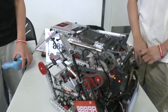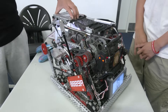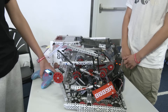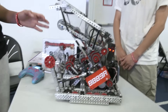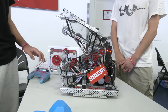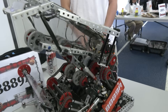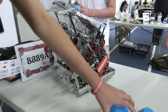What design challenges did you have trying to build a compact robot? I think the biggest thing is getting the geometry right. You can see that the top part moves, so we have to make sure that at all times there's no dead zones in the intake so the balls don't get stuck anywhere. There's just a lot of tuning with flex wheels and roller placements. Can we see a couple of blocks come in, just see how that process works for your team?